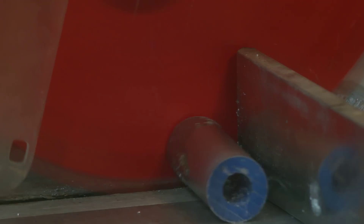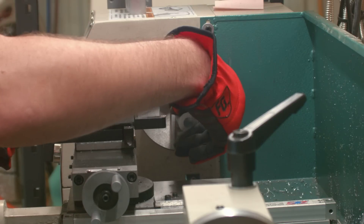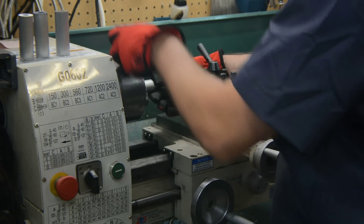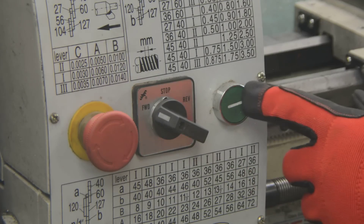After all four pieces are cut, I take them to the lathe for finishing work. The ends are turned and faced on both sides, then bored to fit the 1-inch 10 Acme screw that I bought from McMaster-Carr.